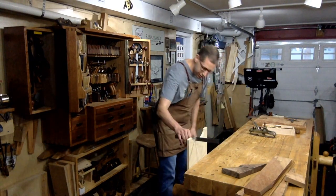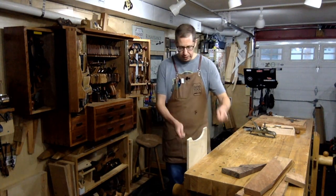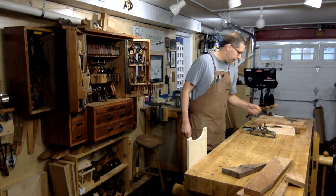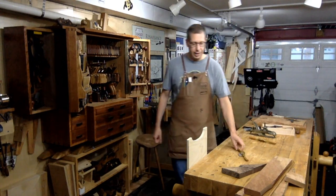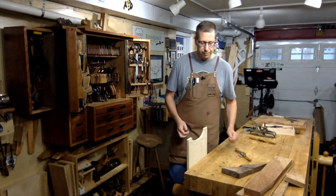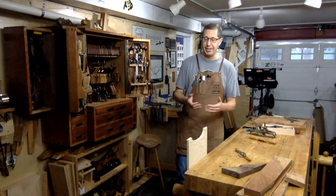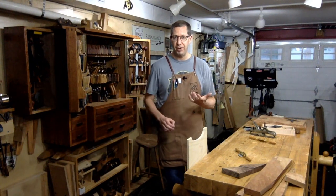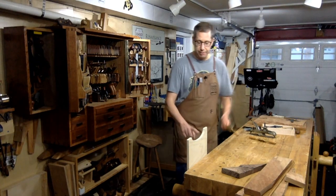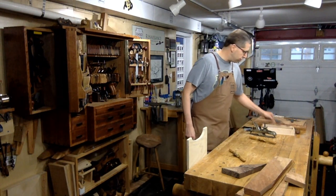This curve is a little out of square — I must have tilted the saw a little when I sawed it. That's fine. What I would want to do is actually do a little bit of sculpting, where I'm actually shaping the surface to get it closer to the final form. Once I've got it sculpted square and close to the line, I want to refine it right back to the line and smooth it. That refinement step is removing the little lumps and bumps that may have existed from either the shave or the saw.